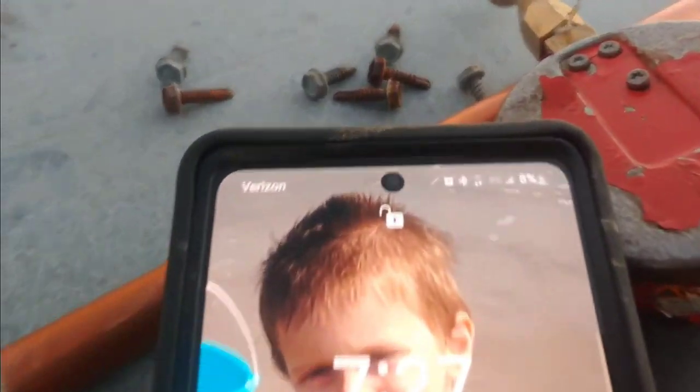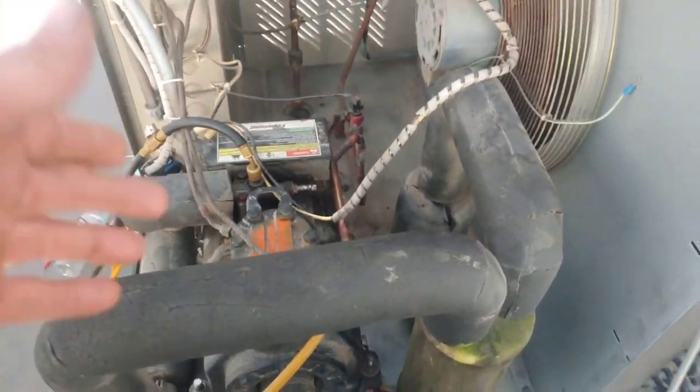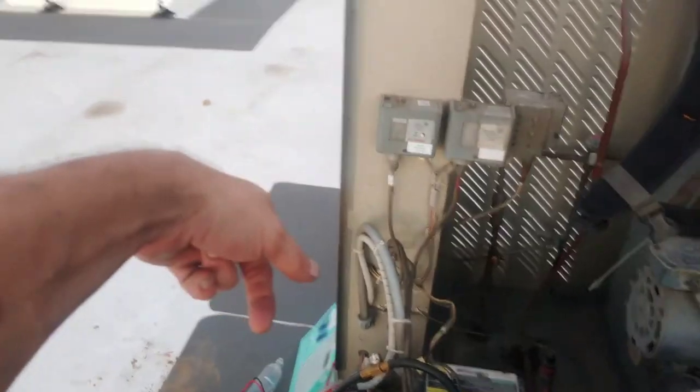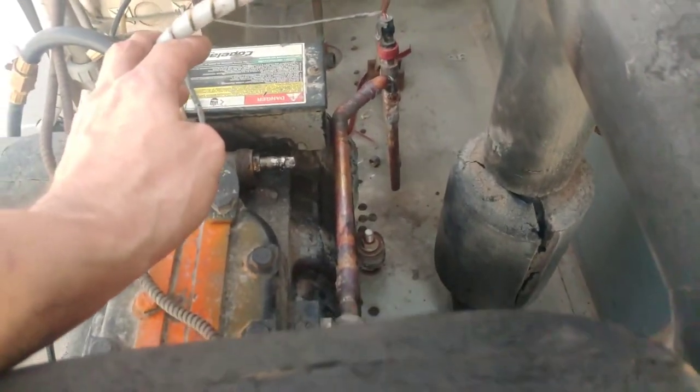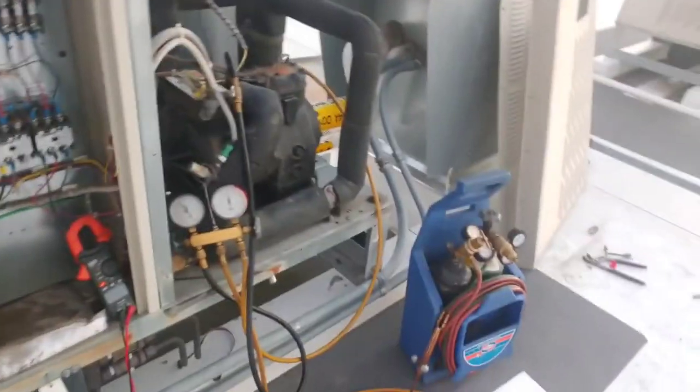I'm going to start putting everything up and getting my stuff out to the truck to finish charging it. My phone's about dead, so for the final recap: we fixed the leak in the evaporator, which is down there underneath us. We also replaced this discharge line right here — look at how horrible it was. So we stopped a future leak today, because this would have turned into one. We leak-checked everything, replaced the dryer, and we're good. Charging it back up now, it's almost night time. Been here all day. Thanks for watching everybody — I appreciate it. Later.